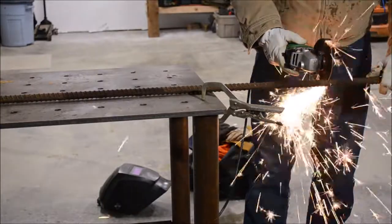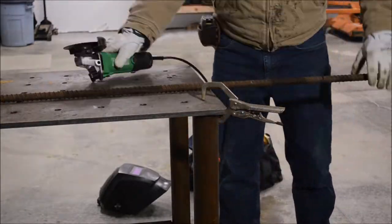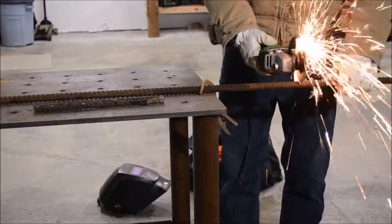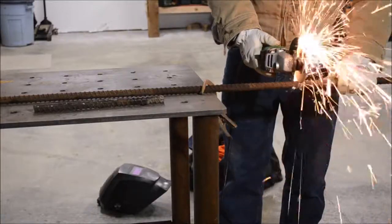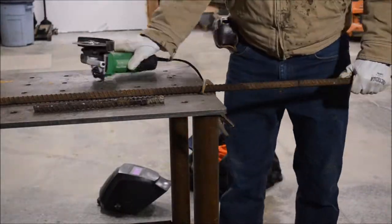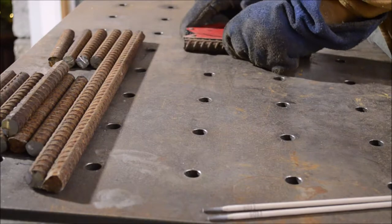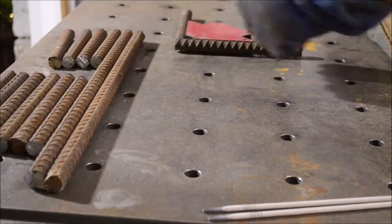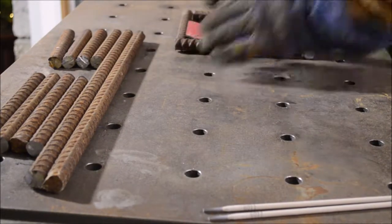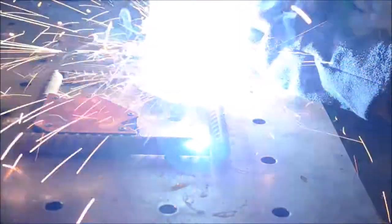So today I'm working with some three-quarter inch rebar. I had quite a few sticks left over from building my house and I'm going to break it down into some chunks. I originally cut 8 pieces for the base and top at 12 inches, but when I put them together it seemed like it was way too big, so I eventually cut those down to 8 inches. You're going to need 8-inch pieces, 2 twenty-four inch pieces, and 4 pieces around 5 inches — though anywhere from 4 to 6 inches works since they just provide a little support for the legs.